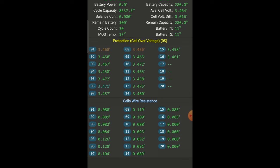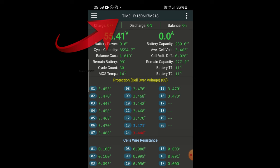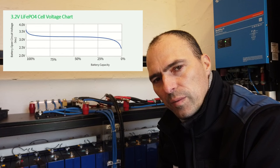I'm very pleased with the performance after one year of usage. You see the remaining battery is at 100% — on this pack it was 99. In version 3 you can specify a certain voltage, and when it trips or exceeds that voltage it will set the battery to 100%. You can see: 1 year, 15 days and 6 hours in use, always connected and performing perfectly. The percentage of capacity left between 3.45 and 3.65 is only 1 or maybe 2%, so don't push your batteries too hard. I prefer to protect my batteries at a lower voltage than pushing them to the limit.